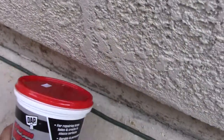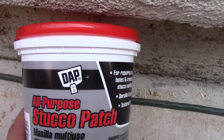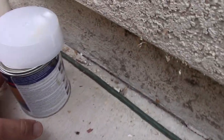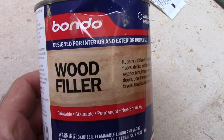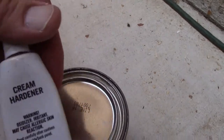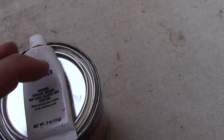For the corners of your house, here's a DAP all-purpose stucco patch. It's basically like whipped cream cheese — you just scoop it out with a knife, square up the side of your house, and it looks really good. And here is some Bondo wood filler. You can fill cracks in the eaves that have been chipped out, as long as the dry rot is not too bad. It comes with an activator; you have just a couple of minutes to mix it up, apply it, then file and sand it down to the level of the wood.